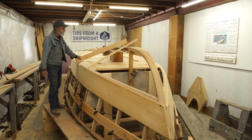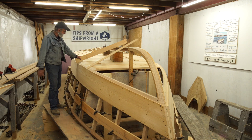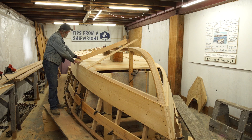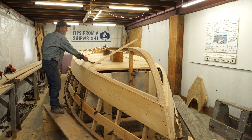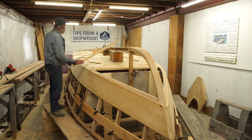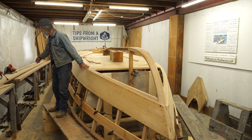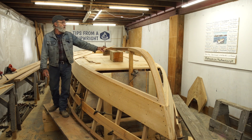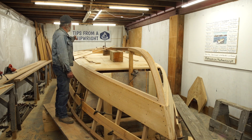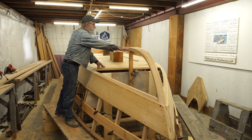That allowed us to get these bevels exactly right. They might not be exactly perfect - I might whittle a tiny bit off the top once I put the real keelson in place, just a tiny tune-up, and it'll come out just as nice as can be. Our next move is to take the planking off, take down our center line and our temporary keelson. Behind us we have a piece of two-by-five-and-three-eighths white oak that's going to make the keelson right down the middle of the boat.